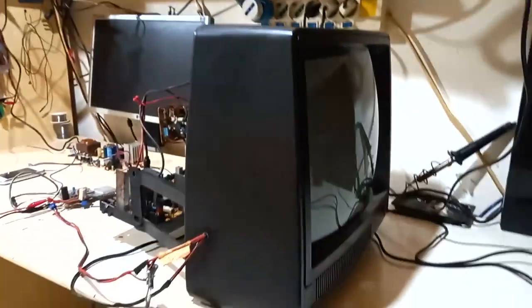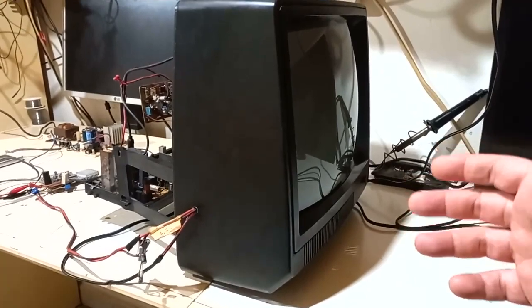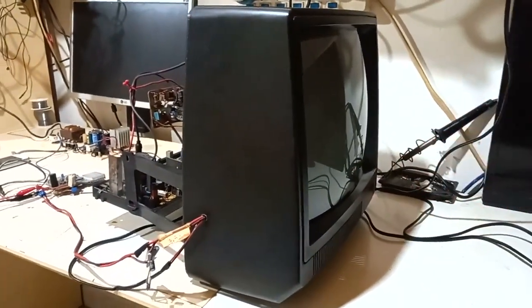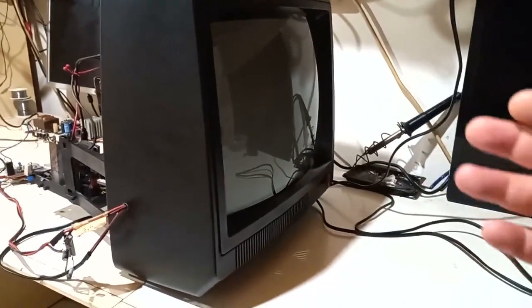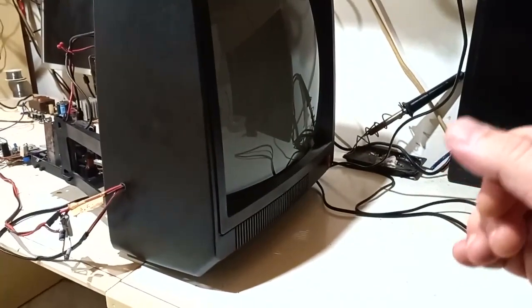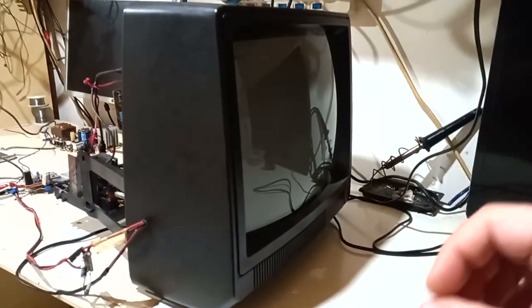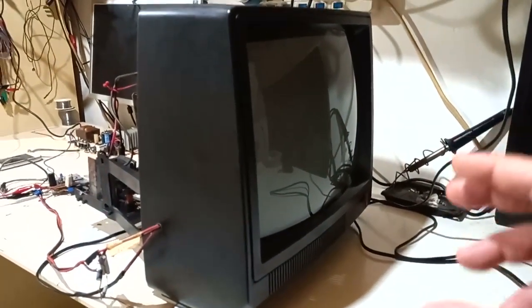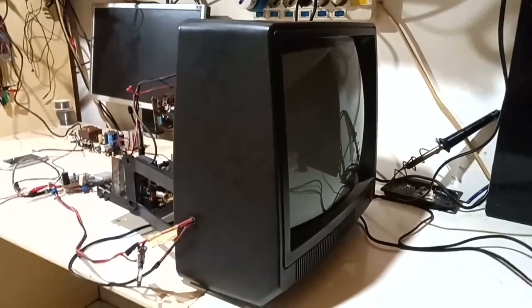What is the best candidate of a TV to make an oscillograph? First of all, it must be a CRT TV, and then possibly a TV from the 70s or maximum the 80s — this one is from the early 90s. The older, the easier to mess with, modify, and hack. Also possibly a branded one or a non-brand, because you'll easily find online the schematic for such a TV, and this will help you a lot. About size, this doesn't matter; I prefer a small one, 14 inches, color TV, because it occupies less space.